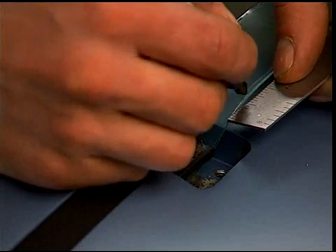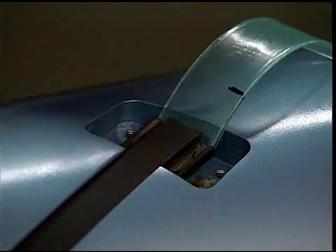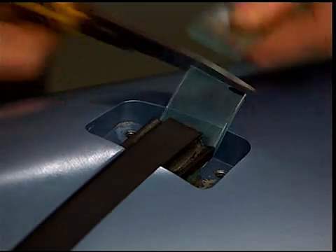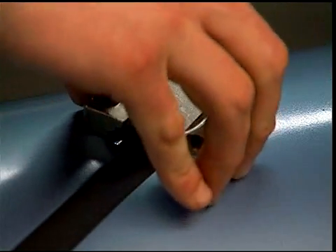At the other end of the shaft, cut the material 9/16 of an inch longer than the outside edge of the element clamp pocket. Then fold the last half inch of the bladder under itself, as was done on the valve end.